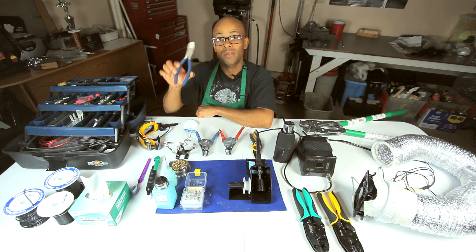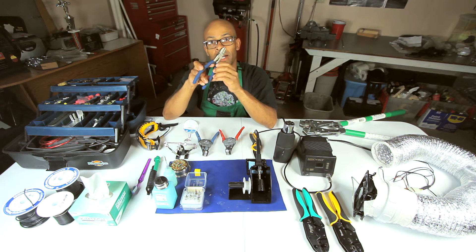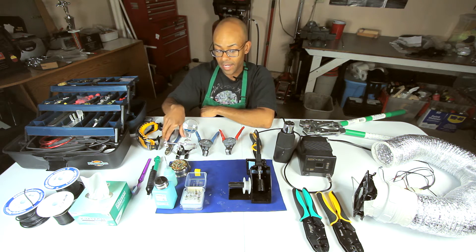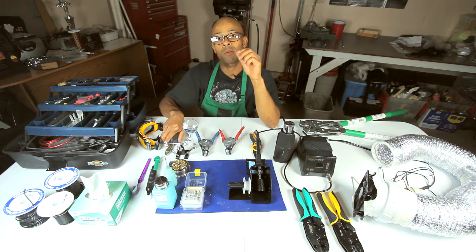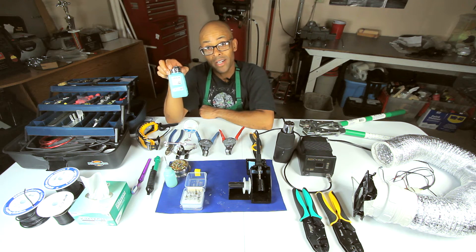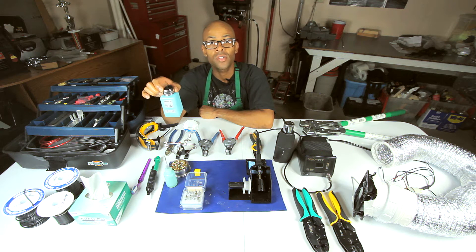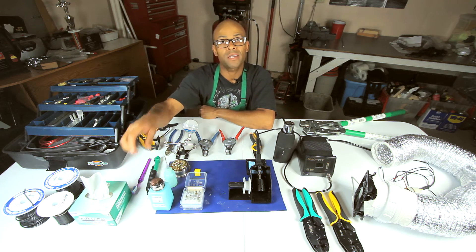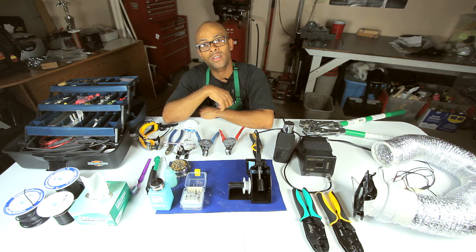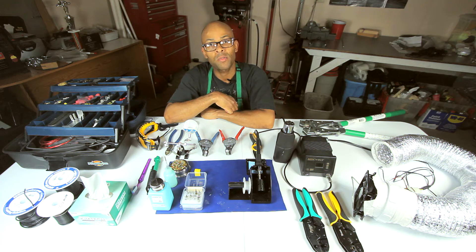It's also good to have wire cutters that leave a flat edge — I'll put a link in the description for some really good ones. That helps with trimming edges around wires, especially when doing wire splices so you don't have excess wire poking into your heat shrink. For solvents, use either denatured alcohol or isopropyl alcohol. I'm using 99% isopropyl. Denatured alcohol is good but sometimes leaves a film on circuit boards, so isopropyl is generally the better choice.